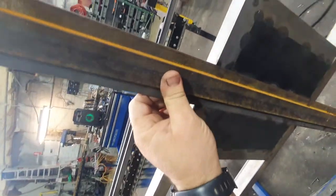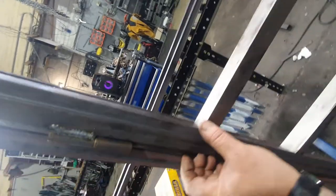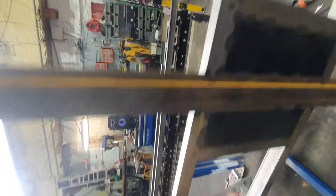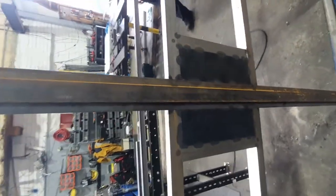You do have a minimum of steel to glass ratio so you have a lot of glass. Your average stile is about 55mm and your glass transoms are about 29mm. The bottom of the doors are 27mm with a 10mm gap. I hope this is helpful — I know I'm not a very good photographer. Enjoy.